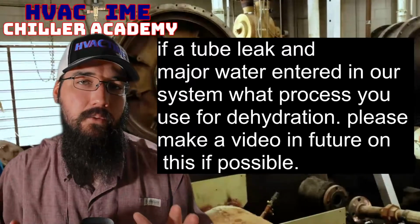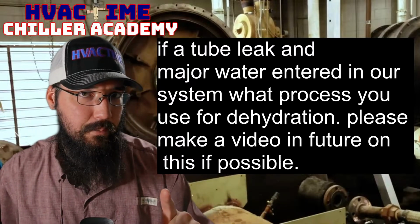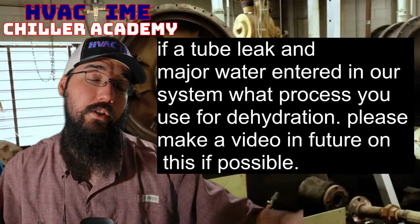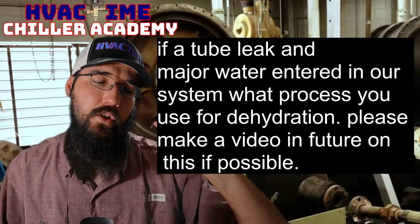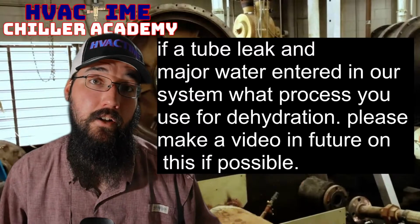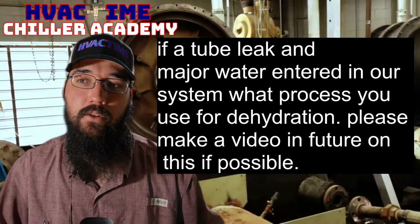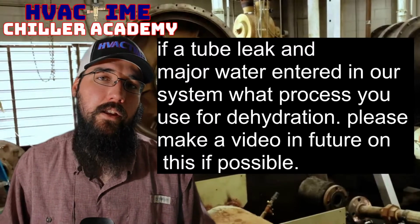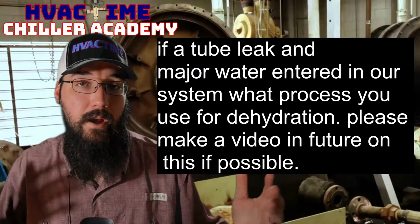Granted, more than likely, when I've had this, what usually happens is the refrigerant, specifically if it's a high pressure, if it's a low pressure, not so much, but a high pressure, the refrigerant will push its way in, because usually the refrigerant's at a higher pressure than your loop, not always, but usually. And so that'll force its way into the loop. You'll think you have a ton of air in the loop. You'll spend days trying to bleed it all. It's actually refrigerant that you're bleeding, not air. And after you get done with all the bleeding and you think you've finally figured it out, but you haven't figured out where the air came from, that's about the time you realize, oh snap, we had a condenser bust or evaporator bust, something like that, right?